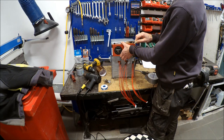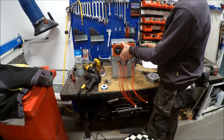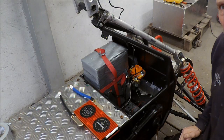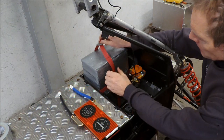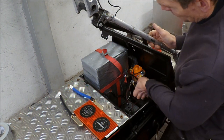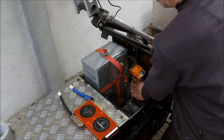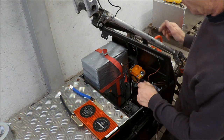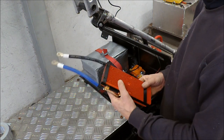I think I have to put it in place so I can see, because I also have the main contactor around here. I put the battery in, wrapped it in gaffer tape, and I will use bands to get it in place — it's working quite well. I also put in the main relay to see how much space I have. The positive side of the battery is below, so I need to make some extensions to reach the main relay. The minus side and BMS are here.